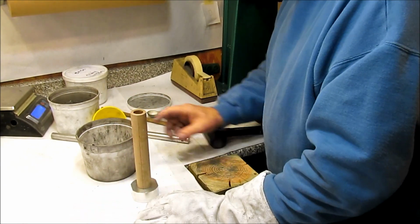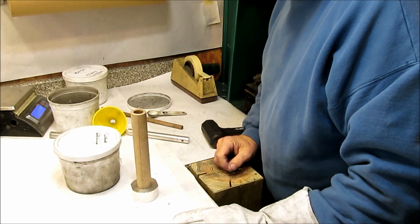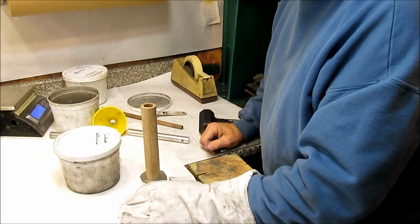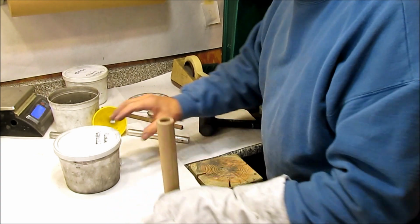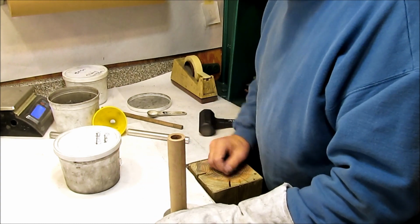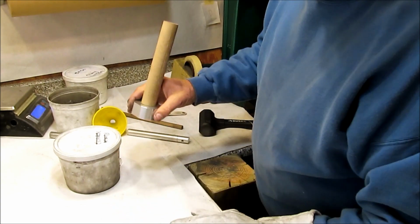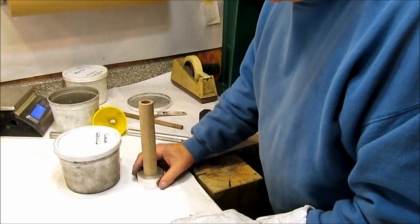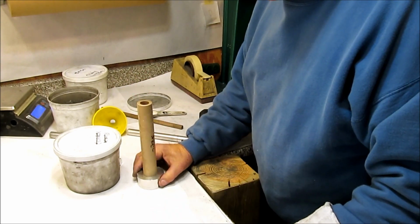Another thing, when I was working with the charcoal, one thing I am going to do is pretty religiously close this tub of composition when I'm ramming an increment. When I was leveling an increment of charcoal spark gerb composition, I was feeling free to just waggle this around on the work table. It's remotely possible I'm going to get a little composition with some metal particles on this work table. I don't want to be grinding those particles between the tooling base and the work table. Lloyd Sponenberg, a well-respected professional fireworker who hangs out in fireworking.com, sent me a little private message to remind me of that, especially when I get to working with metal spark gerbs.